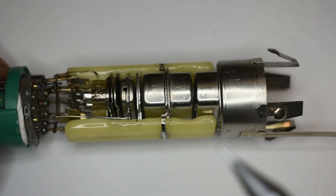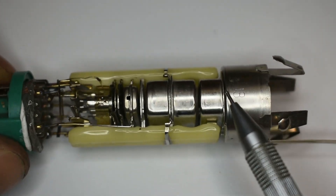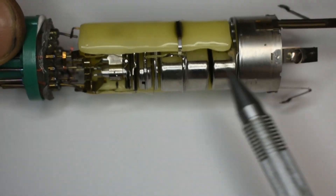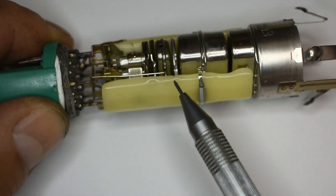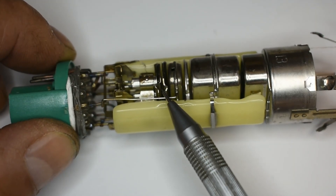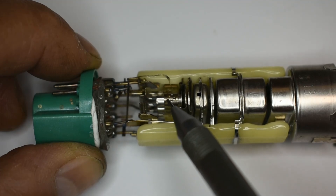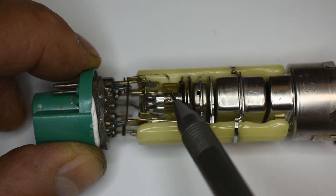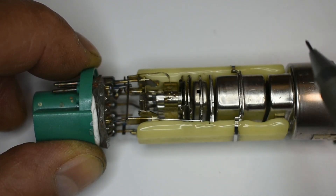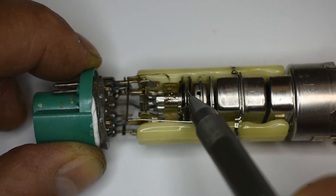The next form of the gun simplified things further — the electrostatic housings all became merged. The final anode and the focusing anode are now one piece connected to one electrode. The grid connection is also one piece and the first anode is one piece. The cathodes are still individually connected. The housings here which almost look like the grid connection are actually the commons to the cathode, with the heater element visible there.